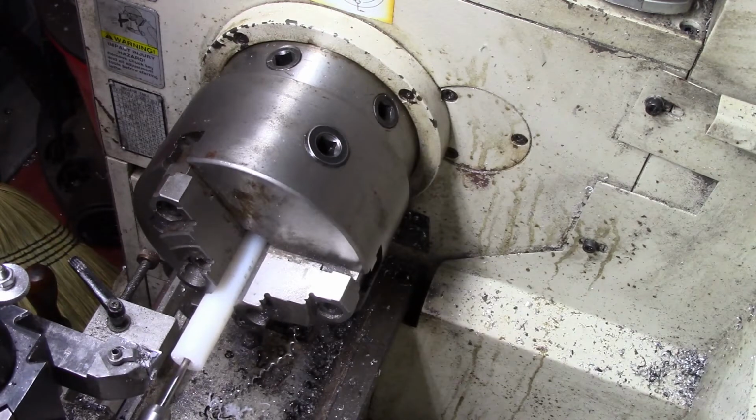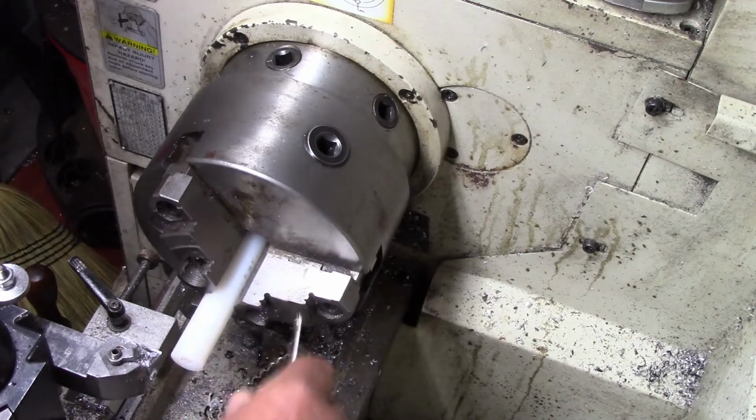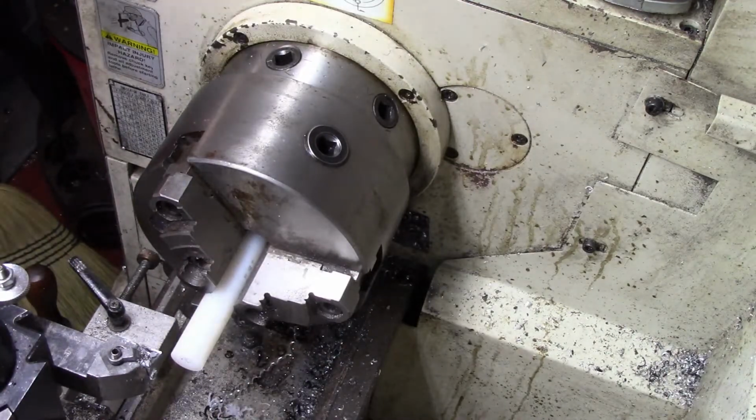Basically what we're going to do is make a bushing, glue it in, and drill the screw out internally for same thing for 10-32. And use the original screw base for the bushing in the base, because of the way the base is made. We'll Loctite everything together, screw the whole doll together, and be done with it.